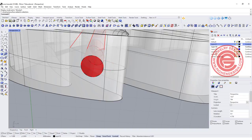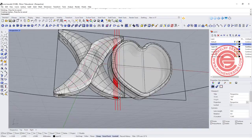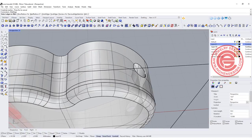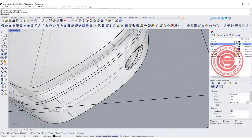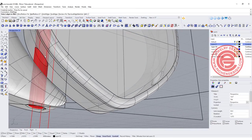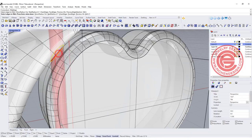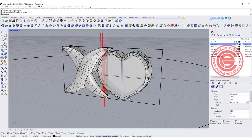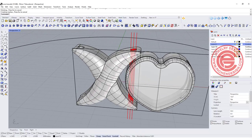In the rendering, it will look like there's a pin there. Some people ask: do you actually need to do the fillet on a lot of things? Ideally yes, because it will just look better in the render. But if rendering is not the main goal and you just want casting, and the fillet is tiny, it actually doesn't make much of a difference on the casting — so no, in that case you don't. But if fillet is part of the design, then yes, you need to do that. It's hard for a jeweler to shape them all in the same way, so in that case you need to fillet that.